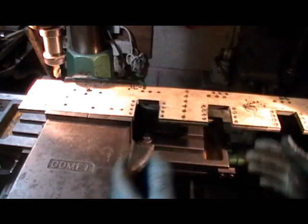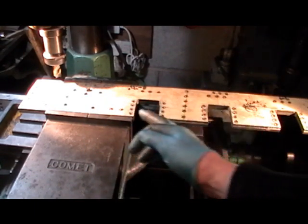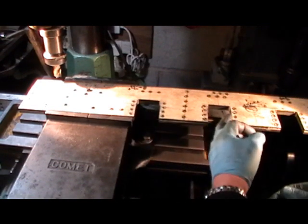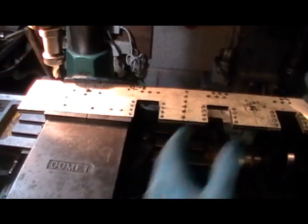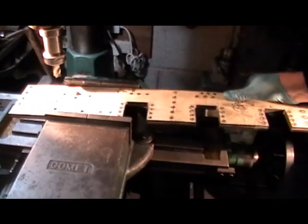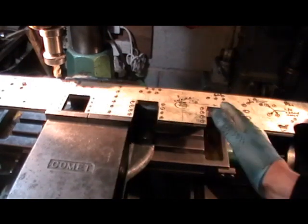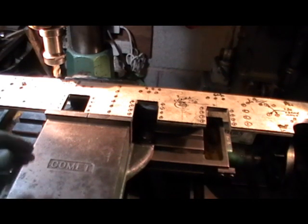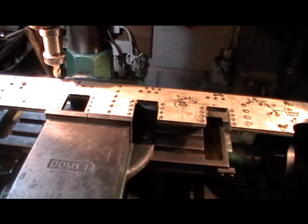Then I moved over with my dials to pick the slot up so I could get an accurate measurement, did the same again with my 5/16ths cutter, took a couple of passes round, that dropped out, then I did a finishing cut. I undid my vice and clamps, moved the whole frame over till the second slot was where the first one had been. I picked one of the machined faces up and moved over the same amount as before to pick my third slot up. I've got them all within a thousandth of an inch.